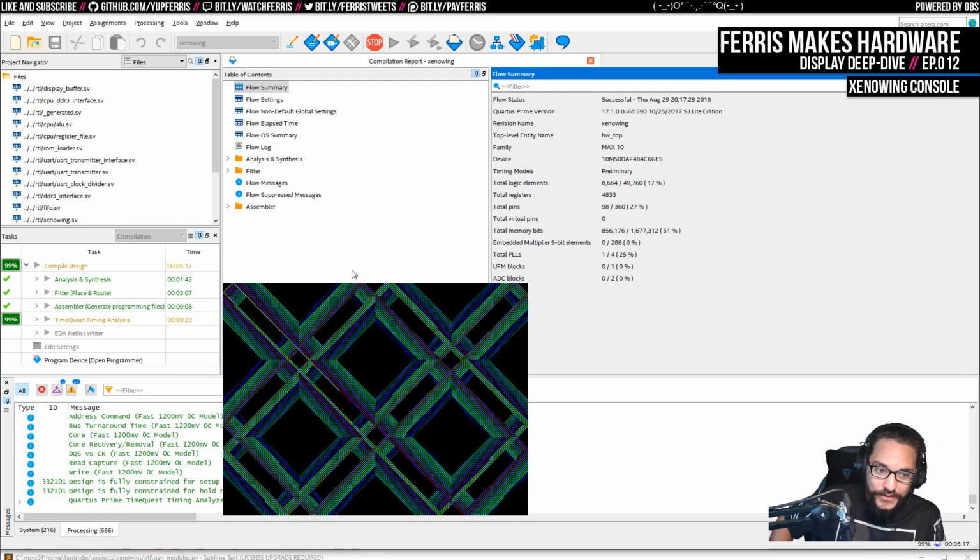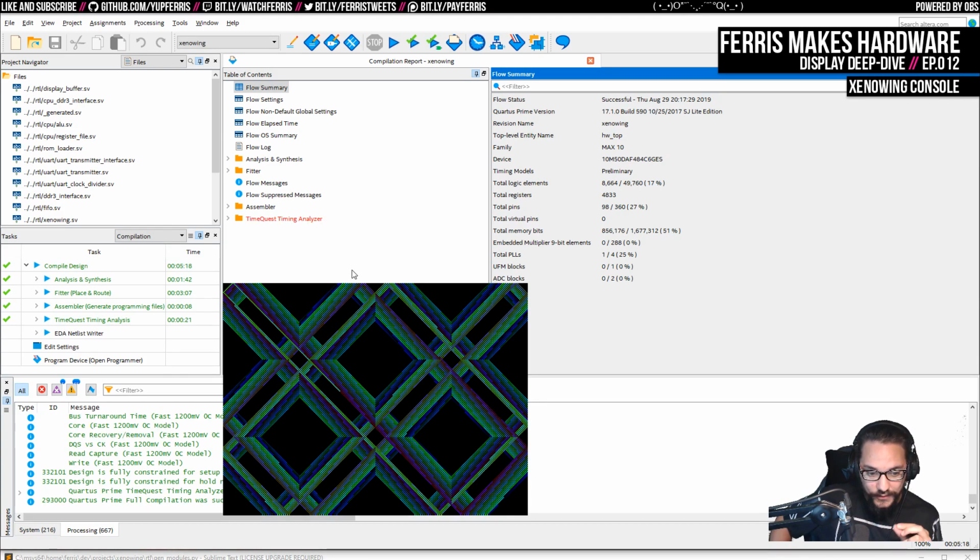Because in that case, the way you do it is you could have a shading parameter that you're also interpolating across the triangle, just like you would with the UVs. And if you've done a rasterizer, which I'm guessing a lot of you have, it's basically the same that you do for the x coordinates anyway. And then we just need to apply that lighting to the texel that I described from the filtering.